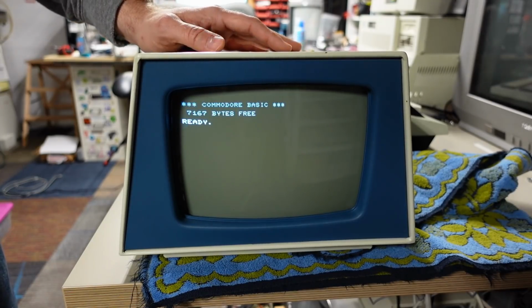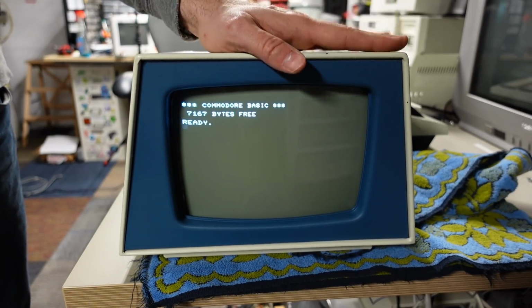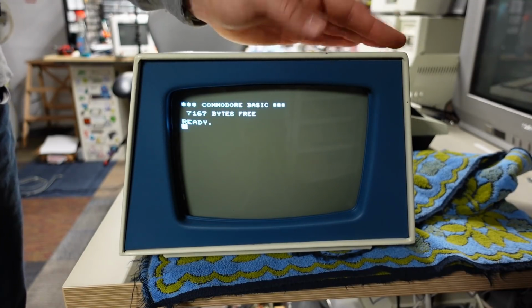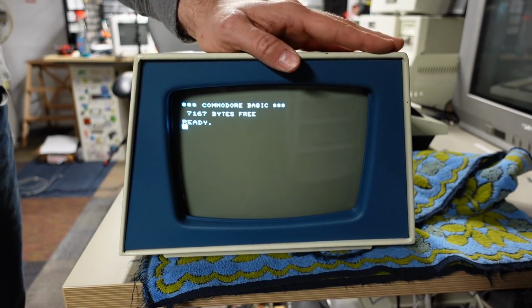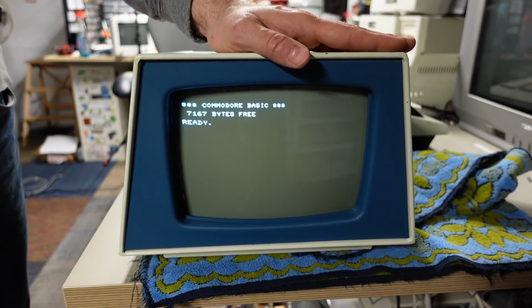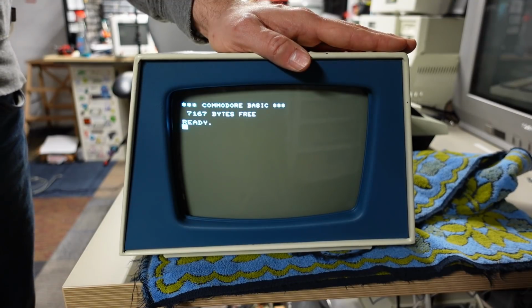Was this the actual fix? I have my fingers crossed that that poor 33 volt Zener has just been abused so long that it leaks. And the new one with that new resistor, so it shouldn't overwork it, should last. But we'll know for sure if I let this thing run for a while and we still have no spot.